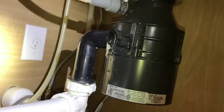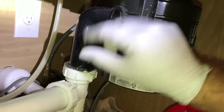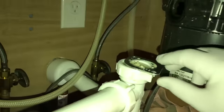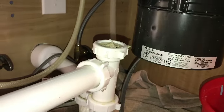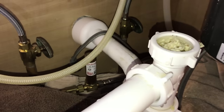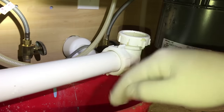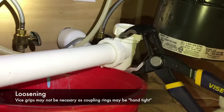Now I'm going to grab whatever is in there and remove the pipe, tossing it into the bucket. When I shook that out I got some muck — that's all pasta, which is a little disgusting, but that's what you're working with. I'm going to take the ring piece and toss it to the side. There we go — we've got our clog. To make sure it's completely clear, I used my hand to get all the gunk out as best I could, but to make sure it's cleared all the way down the stack I'm going to take my vice grips and loosen this up.